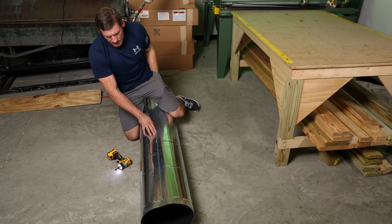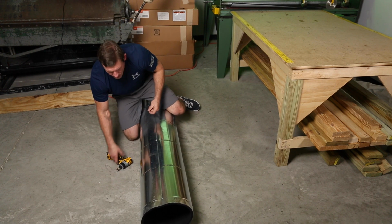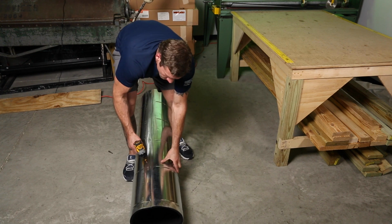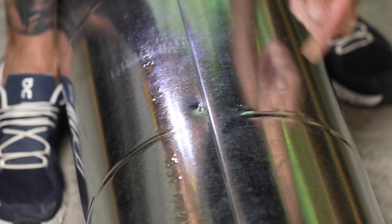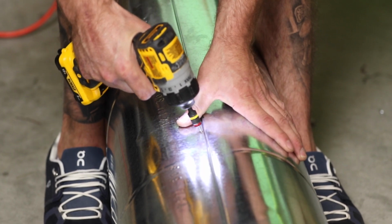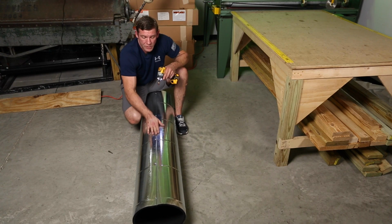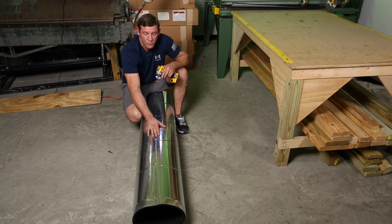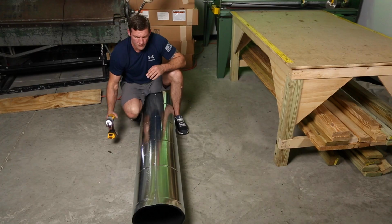And I also recommend in this application that we add more screws. So I'm gonna put a screw here, and I'm gonna put one more screw in between this other row of screws here. On top of that, I'm gonna put hard cast 1402 mastic tape over this, which is a real good adhesive. It'll also help that hold and that seal a lot better.